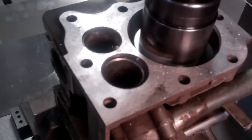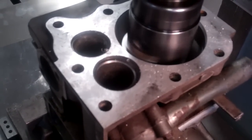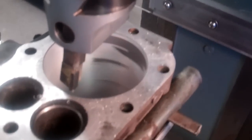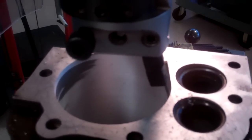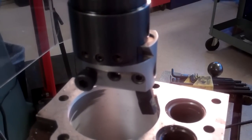I'm not sure 10 thousandths would have cleaned up exactly, but it may have. The bore is kind of oval shaped at this point. I can hear it getting down to the bottom of the bore and it's cutting more consistently now, which is what you'd expect. I've got the first initial boring done. For the most part the cylinder cleaned up — there's a little area in the front and back that didn't clean up completely, but the sides cleaned up all the way down. I only took about three to five thousandths out, so I still have a little ways to go. I'll measure it and take another cut.